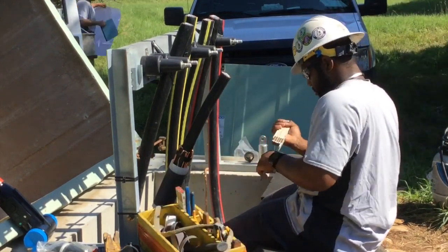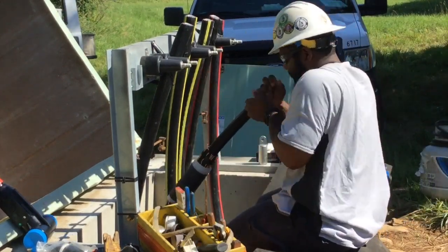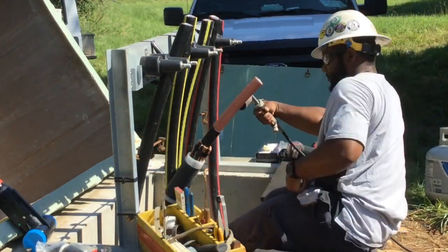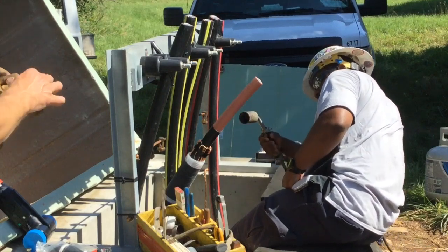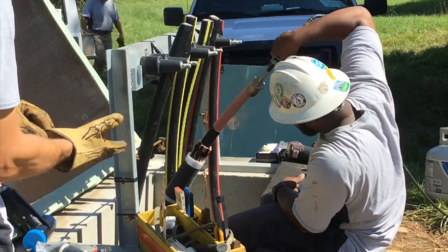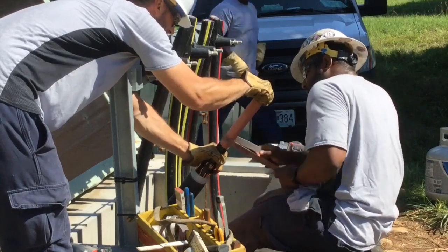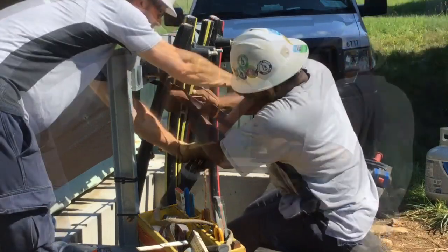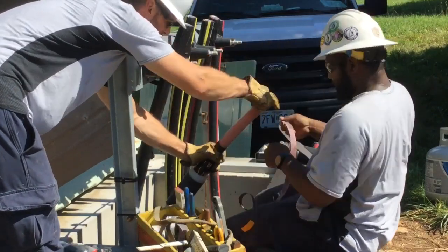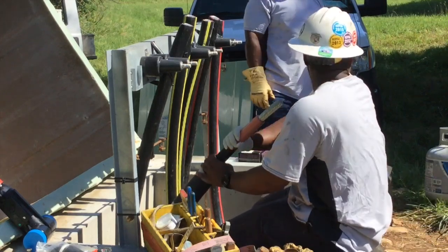Now he's going to measure at the top of the cable clearance so he can peel back some of the semi-con layer, and then using a blowtorch — a heat source — he can loosen up the insulation around the cable. That heat source also expands the insulation a bit and exposes any imperfections, so they can go back in and sand them away. Removing those cuts and imperfections eliminates future cable failure at any of those locations.